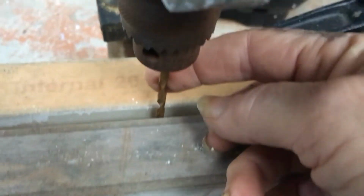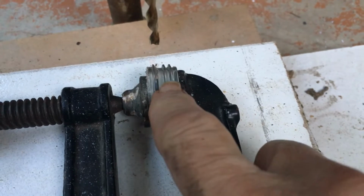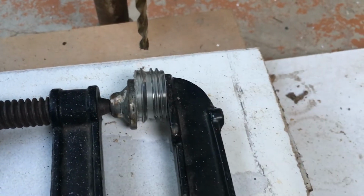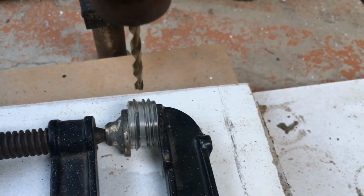I've got my 2 little poles clamped between 2 pieces of wood, and I'm just using the drill press, and I'm using a drill bit number 4.5, so just drilling in 2 centimeters from the tip, and just drill through both pipes. And now I'm going to be drilling through the little plastic pieces like that. We're going to drill through both sides, so I'm just holding it in a clamp, and I've got it on the drill press, and I'm going to drill through both sides.